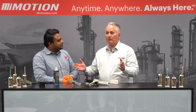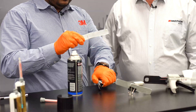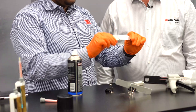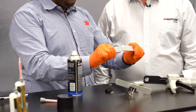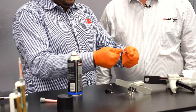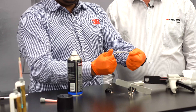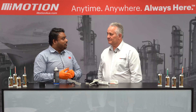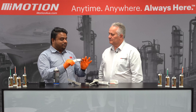With the magic of time, we've done one just a little bit earlier. Now this is something that we did 20 minutes earlier. So what we'll try and do is we'll try and bend this. The idea is if the aluminium bends, that's all good. Can you see the aluminium bends without breaking the bond? And this is still only 20 minutes. It will take 24 hours to fully cure, but the initial 20 minutes is more than enough for you to bend aluminium.